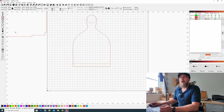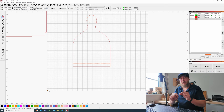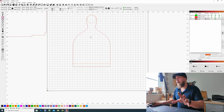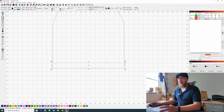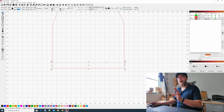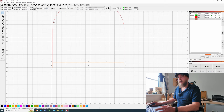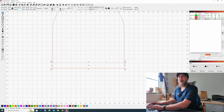Because I'm using 6mm thick MDF, my overall measurement at this point needs to be 148mm. With this rectangle that we've just drawn, we need to make the height of it 6mm. If you're using a different thickness material, keep this specific measurement at 6mm — if you only have a 3mm lip it will probably be very fragile and break. Click the bottom left corner of the position reference so that when you adjust this measurement it only changes the height from that point, then type in 6mm, make sure the padlock is unlocked, and hit Enter.